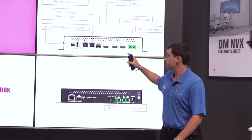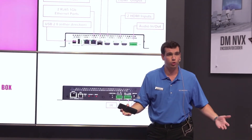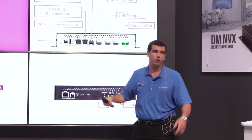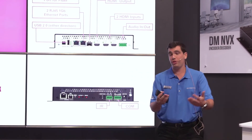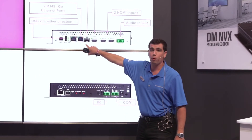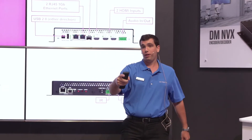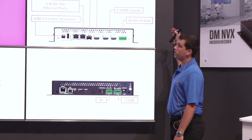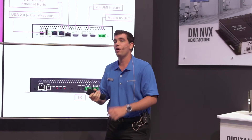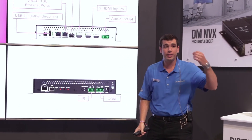Here's a close-up look at the device. The device and host ports are for USB 2.0 routing — those are your KVM solution. I can either receive the PC or have the mouse and keyboard connected to that port; you can't do both at the same time. There is a three-port Ethernet switch with two copper ports and one fiber port. The first copper port can be used for the uplink, the second as a courtesy port for your TV or projector. The fiber port is for long-distance extensions that exceed the copper.